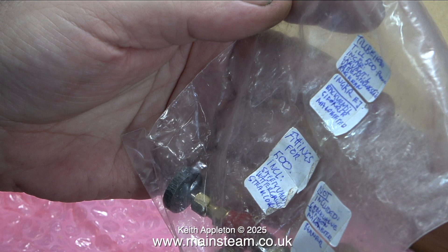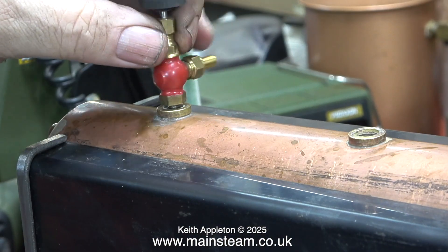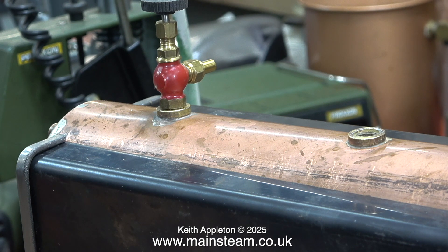The Stuart boiler fittings for the 500 and 501 boilers are the same. The fittings for the 504 boiler look the same except the threads are larger where the fittings screw into the boiler. For the 500 and 501 boilers: the water gauge uses 1/4 by 32 threads per inch, the check valve bush is also 1/4 by 32, and both the pressure gauge siphon and steam tap adapter on top are threaded 3/16 by 40 threads per inch. A little Loctite 542 will fix any looseness in the thread.